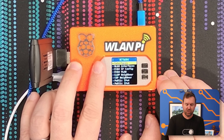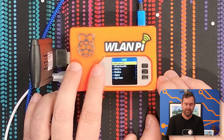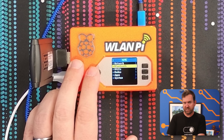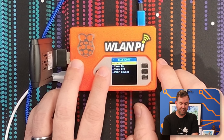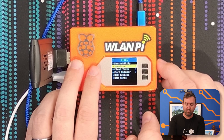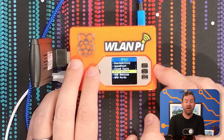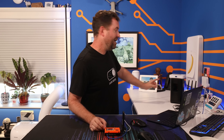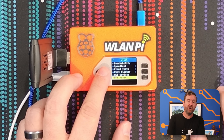Looking at the home menu, we've got Network, which shows information about our interfaces and wireless interfaces, and lets us do some configuration. We've got Bluetooth functionality — I haven't played with it yet, but it can do Bluetooth Low Energy stuff. Inside that menu we've got status, turn on, turn off, or pair devices. Under Utilities, we have reachability, a speed test we can run right through the interface, cloud tests for Aruba Central, Extreme Cloud, Mist Cloud, and Ruckus Cloud. There's a port blinker that flaps the RJ45 port to let you locate where this device is on whatever switch it's plugged into. We can also see USB devices and look through firewall ports to see what's open.